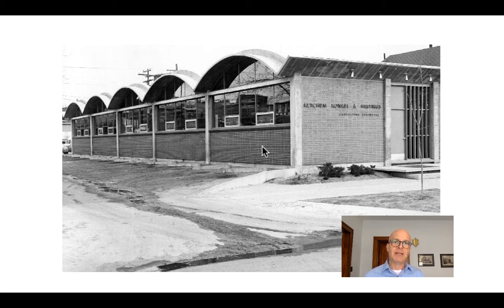This beam here is doing a couple of things: it is taking some of the tendency of that corner to flatten out, and it is balancing it against the corner on the other end of the building.